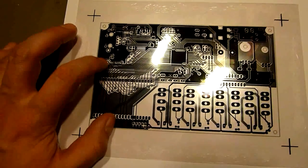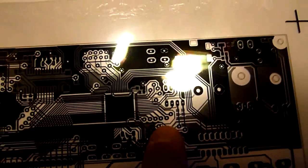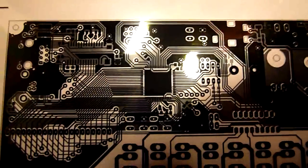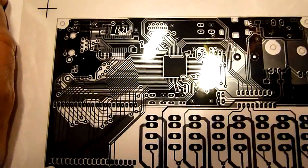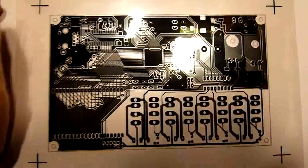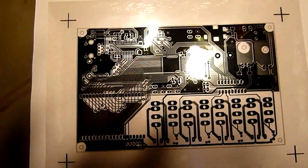Those are the most important things about making a good photo positive PCB film. If you have a good film and a good resolution — say 1200 DPI with a good printer — you can make 6 mil tracks. There's always a limiting factor: if you want to use very fine drills you'll need a CNC-controlled drill, because by hand you won't have the accuracy. You also need a good exposure machine with vacuum or similar. But making 6 mil tracks with a good printer and a good film is not really a problem at home. Just don't make the tracks smaller than they need to be. I hope I gave you a few good tips — have a lot of fun making your own PCBs, see you soon!